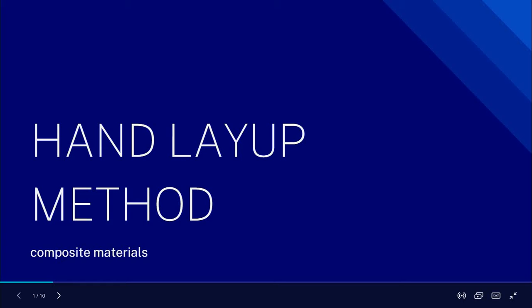So normally in the last classes we saw many methods of manufacturing composite material, but those need high material cost and power equipment. But the hand layup method is a simple, traditional method for manufacturing composite material. It only needs skilled laborers for making a required composite shape. So you need a mold of the required composite shape. You can print it using 3D printing, or use any steel or aluminum mold.